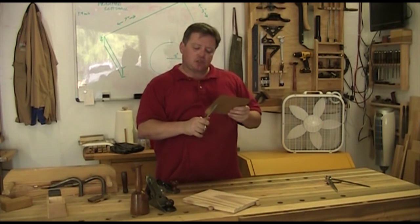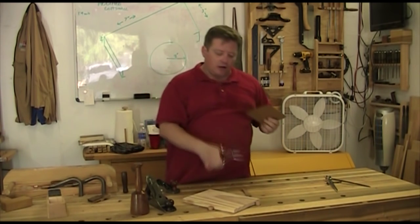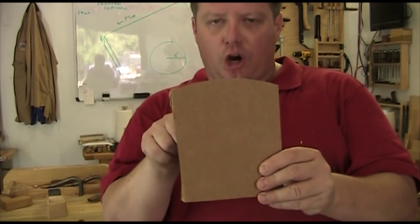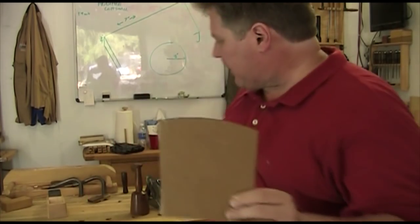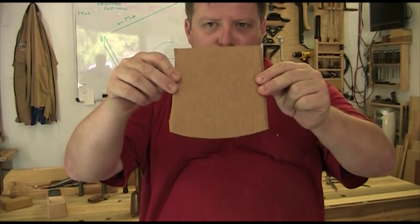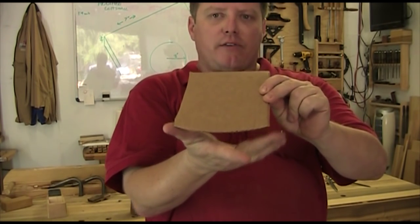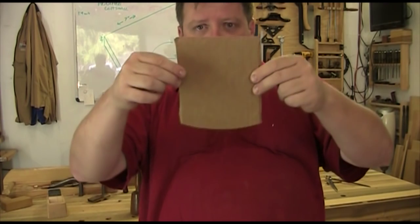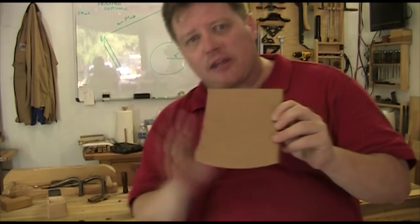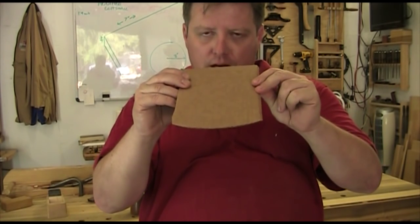Now this is extreme to me — I don't have any plane blades with an 8 inch radius on them, but it is a good example of what I want to talk about. You have this 8 inch radius which is a pretty steep curve, but this blade doesn't go into the plane at 90 degrees, so you don't get that full angle. Most planes have it at 45 degrees, which means the actual curve resulting on your board is about half that distance — roughly a 16 inch curve. What I like using is an imperceptible, minute curve, which becomes even smaller when you put the blade at an angle.